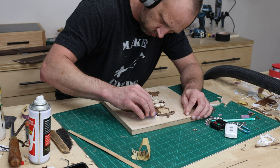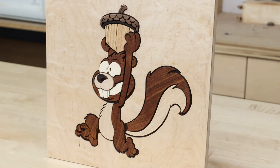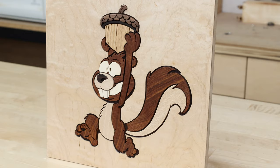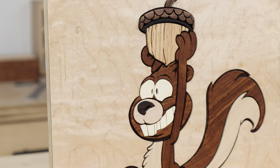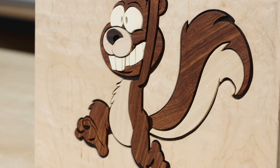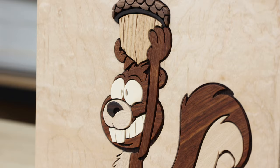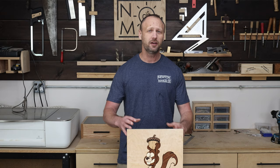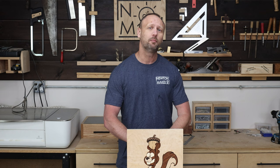After I got the last pieces in place, I took some time, sanded the entire project, and made sure I didn't have any glue squeeze out between the pieces. Once everything looked good, I sprayed the project with some satin lacquer from a spray can. How cool is that? All I have to do is throw it into a frame if I feel like it. I did make it look a little complicated by doing this whole crazy glue up for the panel, but it doesn't really have to be that way — you could take all these pieces and just glue them onto a regular board and get the same effect. Hopefully you enjoyed this video. If you did, consider subscribing to the channel. Until we meet again, get in your shop and build something awesome.